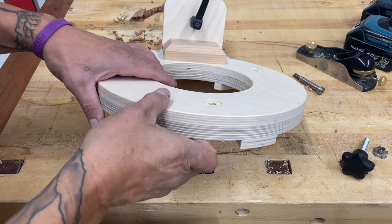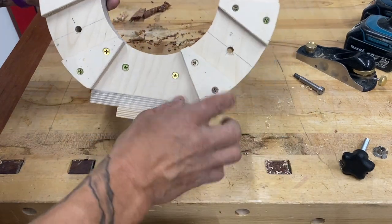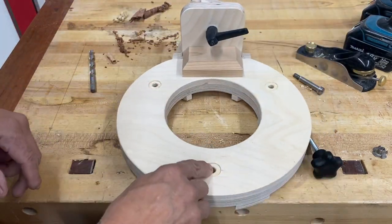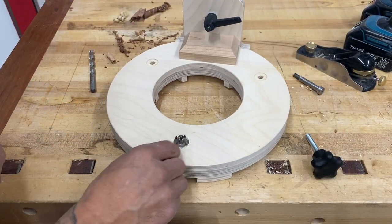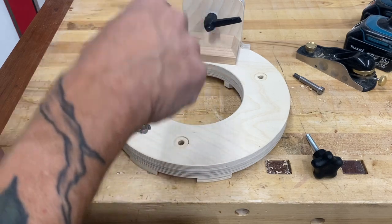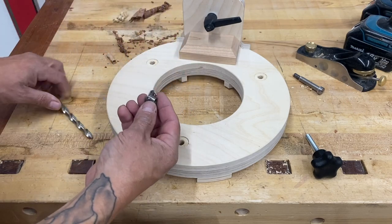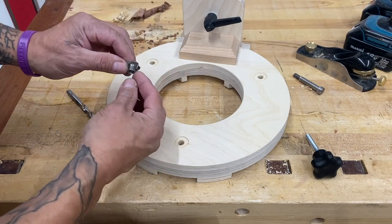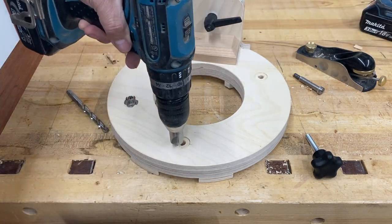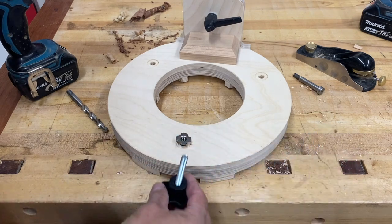With this constructed, I really should have drilled these holes first, but no big deal. I've got a five-sixteenths through hole. First I did a counter bore, which is probably not even necessary, but I like the way those T-nuts sit in there. So I did a counter bore, then the five-sixteenths through hole, and then I drilled part way through with a three-eighths to accommodate this shoulder. And then this part in here is round, so I used a countersink on that. Lock knob from the other side.